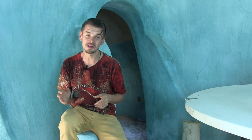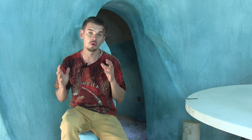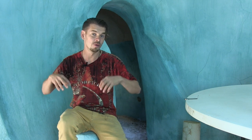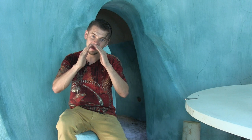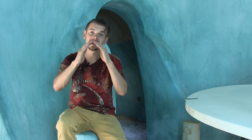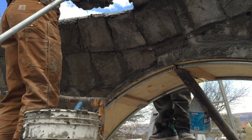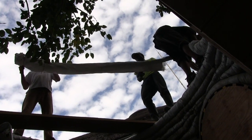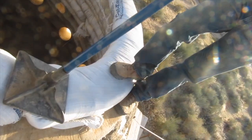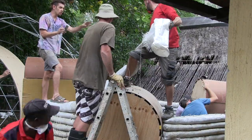It's going to be fully jam-packed from morning until 6 o'clock in the evening. We're going to graft and we're going to work hard, and you're going to learn all the details necessary to construct these two types of dome homes from two types of materials with two types of geometries, because the Air Crete dome is actually a Roman arch geometry and a sandbag dome is a lancet arch geometry, more of an egg shape. So you're going to learn two types of geometries, two types of materials and two types of different dome homes. So come along for the journey. It's going to be absolutely incredible.